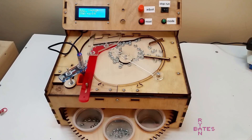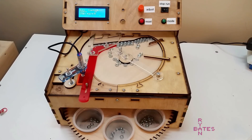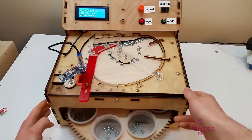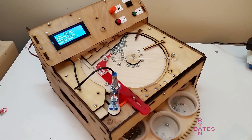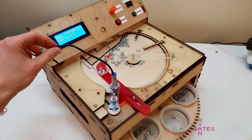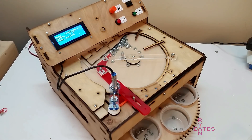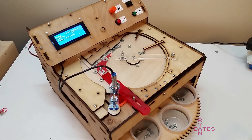So how accurate is it? It's near 100% accurate for larger parts, something like number 8 and number 10 nuts. But smaller nuts like number 4 nuts — these are imperial sizes — occasionally tend to get too close for the sensor to catch every single one, and the accuracy reduces to 96 to 98%. That gets a little better with a larger sample rate, but I'm kind of impatient for this video.